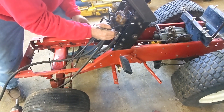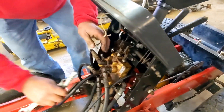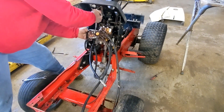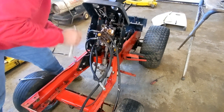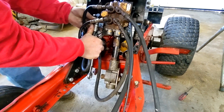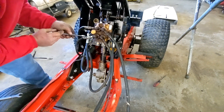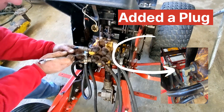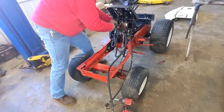I'll find some place to put that off camera. You're going to check it — here's your 'out,' it's going to be on the top, says 'out' right there. I'm going to turn that fitting just a tad and loosen it up on the O-ring a little bit. Eventually I'll get a plug and plug that off right there — I'm not going to put power steering on it. But that makes your live fluid for your hydraulic orbital motor. Now we're on to the lines.